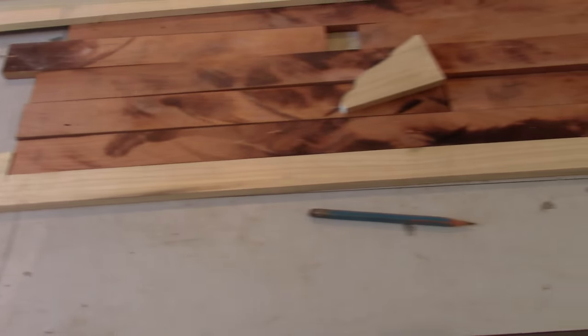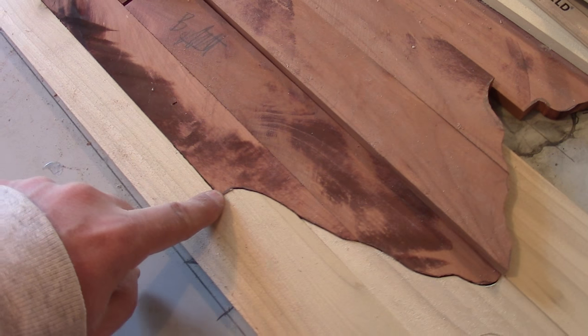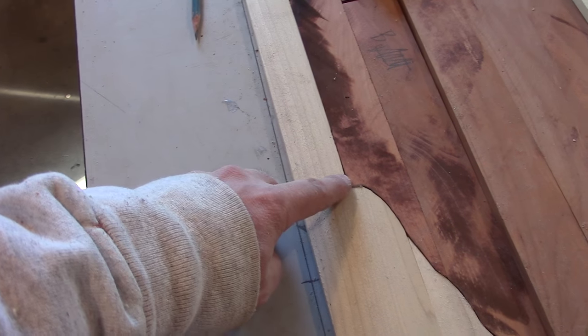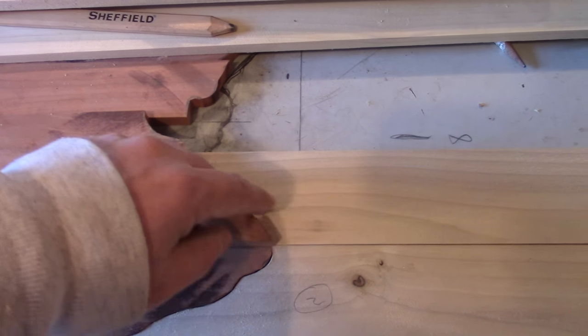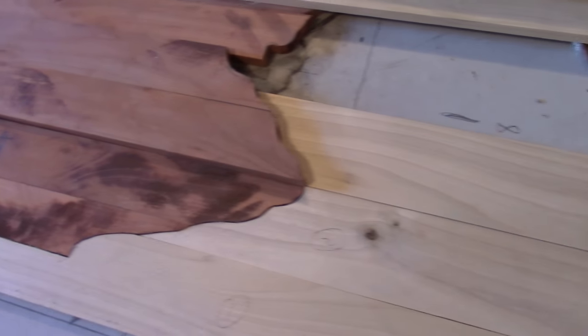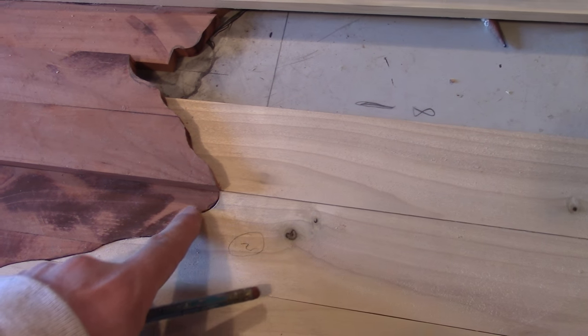Here's how I'm doing this: I started with the bottom piece and notched it out — the seam is right here, about half the piece starts there. I figured out I wanted to make sure I didn't have a little piece on the end, so I notched it about an inch. Now I'm picking up these pieces and tracing them on top of the board to get them nice and tight, leaving the ends long so I can push them in to tighten and adjust. I just got to trace this and cut out that profile.